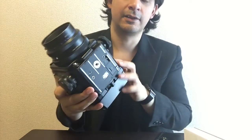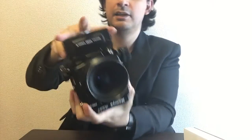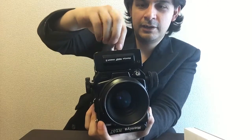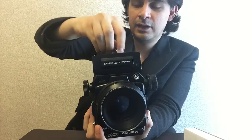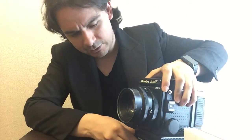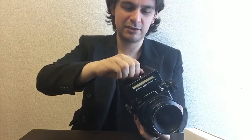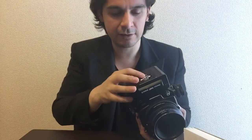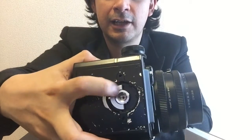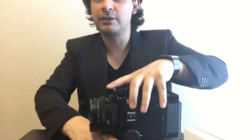There's the gear — it doesn't come out, it's just waiting for something to engage it. There are also contacts and the screw. Align the winder with the alignment pins, and you can see it pop out a little. Then screw it in — it doesn't need to be extremely tight. I've found a couple of times that if you put it really tight it actually doesn't work — it doesn't let anything move. Just make it snug. The alignment pins keep it in place, so don't over-tighten.